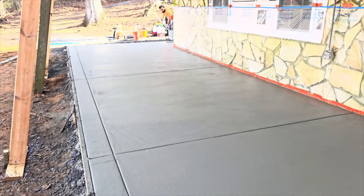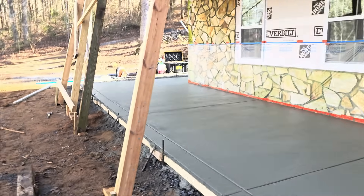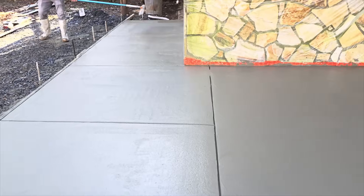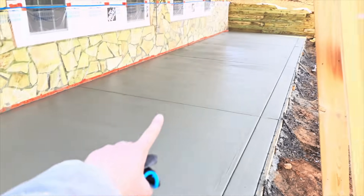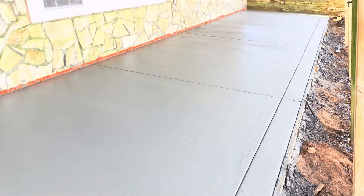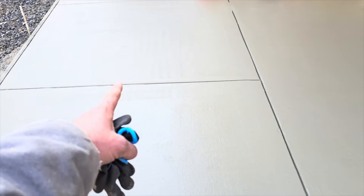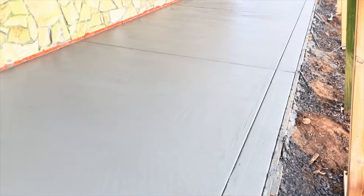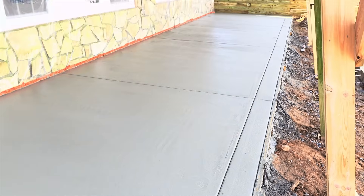We got our border cut in, ran our slicker across it. For some reason that last panel down there is a lot drier — we'll start down there, open the joints back up, I'll cut back through, and Shiloh will start on knee boards going down that wall fixing joints as he goes. Then I'll reach out with a funny trowel, Britney will go back down the edges, we'll slick it off, and get ready to broom.